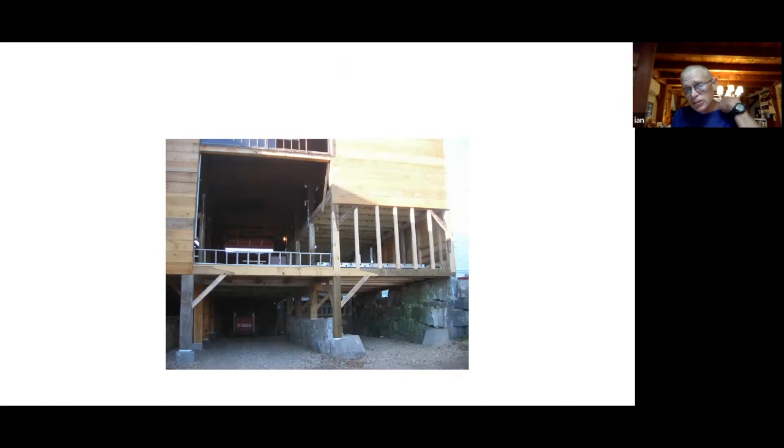Here's a picture of the rear of that barn — you can see the locking lap joints running across the gable on the sill. You can also see the bottom of the post on the right of the central aisle has a repair — once again a locking lap joint. When that's pegged, because of the angles not only in the short shoulders but in the long angle of that joint, it maintains the structural integrity and keeps it from moving. You can add epoxy in that joint to glue it and make it even more secure, but you want to make sure the trim is maintained so it doesn't have a problem going forward.